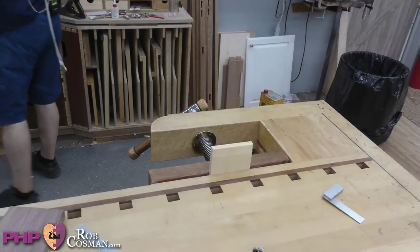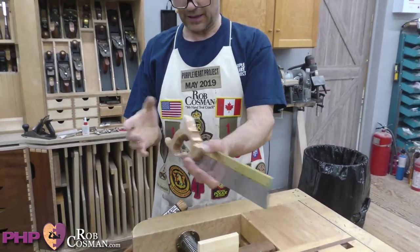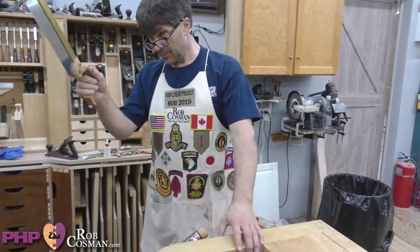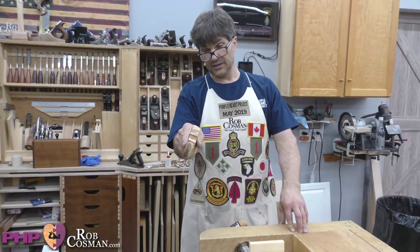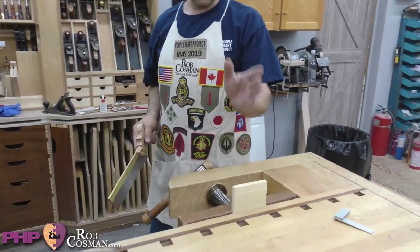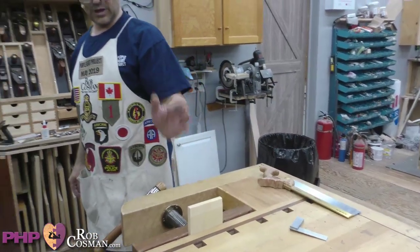And I'll say this, even if I've said it before: because you have a saw that registers in your hand the same way every time you pick it up, never changes, and because it's nice and heavy, gravity will actually train you where plumb is, and you'll eventually be able to even make a plumb cut with your eyes closed. You'll also learn where 10 degrees is to the left and 10 degrees is to the right, and you just learn those three. And believe it or not, that'll actually come. That only works if your board is standing plumb. That's one of the two variables. This is the easiest one to control. So every time you put the board in the vise, make sure it's standing plumb.